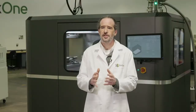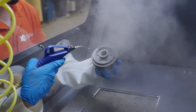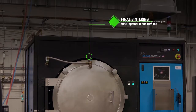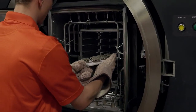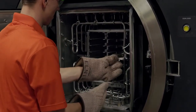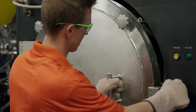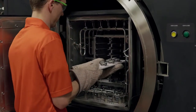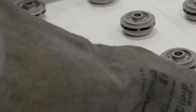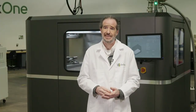After your part's cured, you need to remove it from the powder bed and prepare it for sintering. Sintering is the final step of the binder jetting process for metal — it's also the step that really proves whether you've printed a structurally sound part in all those prior steps. Any problems with your 3D print will be exposed in sintering. That's why our entire process is tightly focused on delivering highly dense green parts, because the better your green density, the lower your distortion, the lower your shrinkage, and the tighter your tolerances.